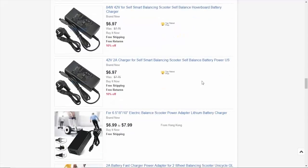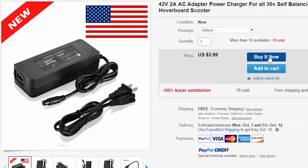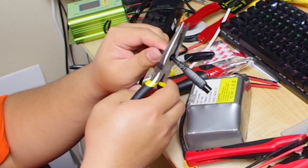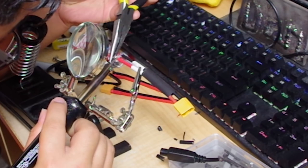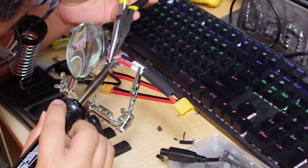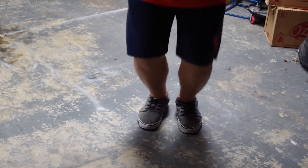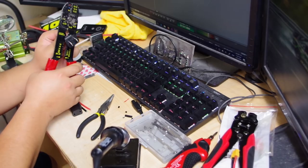Now, the battery charger build. In this case, Daniel purchased the hoverboard charger from eBay. Cut into the charger cable — no, not that side; the side that goes into the hoverboard — and then solder in the XT60 male connector. For the main charging cable, first make sure the cable's long enough — you know, like you could jump rope with it.